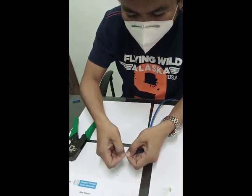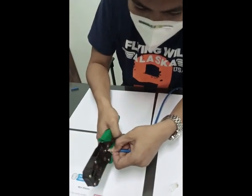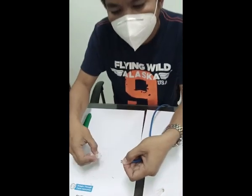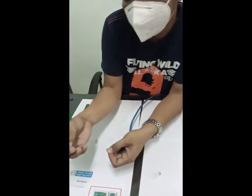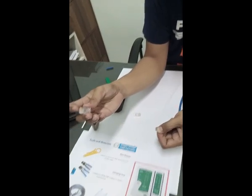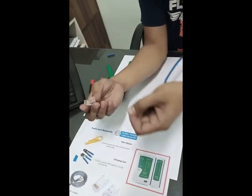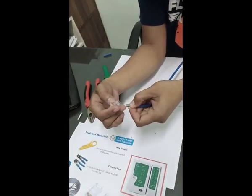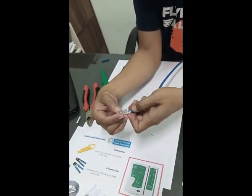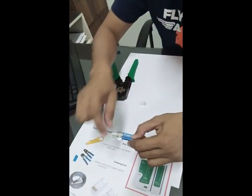Once you have arranged them, re-arrange and form them evenly. Once ready, insert them into the RJ45 so the copper wires face the front. Left to right: left is white-orange, right is brown. Insert it fully — fully inserted.